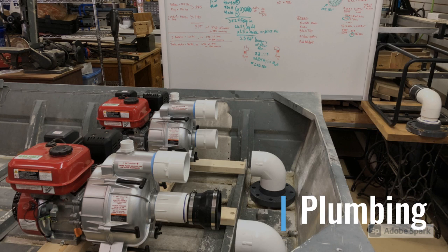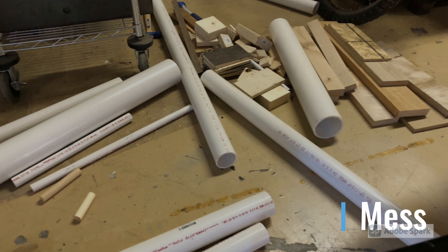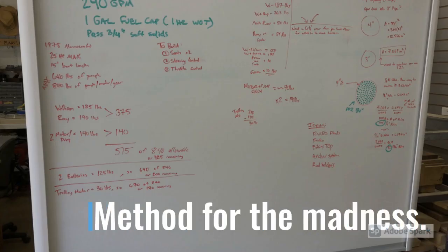At this point I had attached a few of the plumbing fittings that threaded onto the pump housing, and had bought the flanges that I would attach to the floor - those were schedule 80 gray pipe flanges like you'd bolt a large pipeline together with. I mounted those to the floor of the boat, then brought that up with an elbow and started planning how I'd tie it in and exhaust it over the back of the transom. While I was building, my two-year-old came out to play with all the pipes. On the dry erase board you can see my notes on how much things weigh and how many holes I needed to drill to be equivalent to a three-inch pipe.